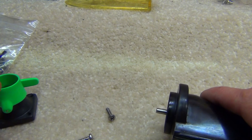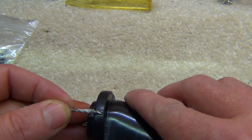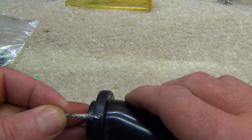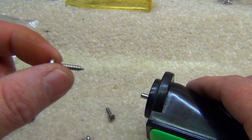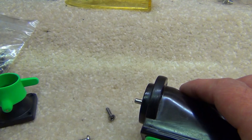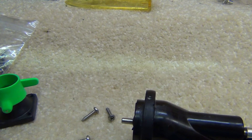Once it's fitted in the boat, drill 6 millimetres deep — you don't want to blast through the other side. If you do, you can put a bit of Shoe Goo on it, but with the thickness of the hull, 6 millimetres gets you to about the right depth. Use self-tapping screws, put them in by hand slowly, and don't rush them in.